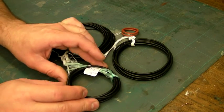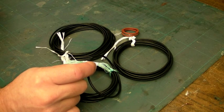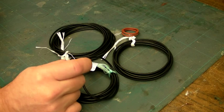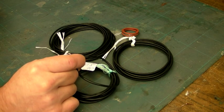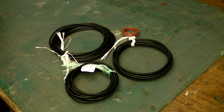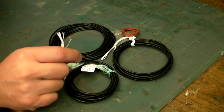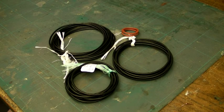For the majority of model submarine construction, most people want cylinder sizes of between 2 and 4 inches. For those cylinder sizes, I would say you want seal cross-sectional sizes of between an eighth and 3/16 of an inch. If you go thicker than that, you're likely to increase friction and reduce the available space inside your module, since the end cap must be made thicker to accommodate the seal. It's not really necessary to go thicker than that.